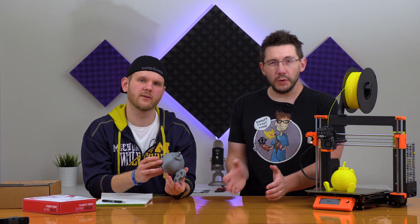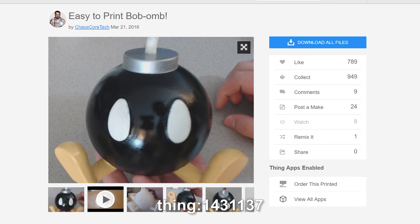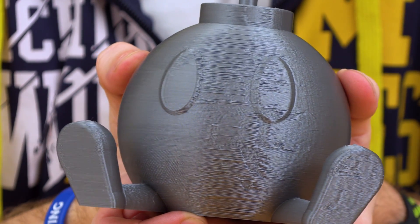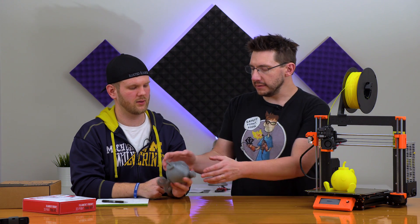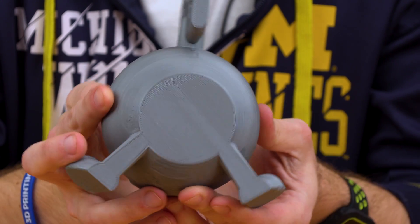When I was in Seattle, Sean texted me saying he was having an issue with his Prusa machine — it had never really printed well. He showed me this Bob-omb, designed by Chaos Cortex on Thingiverse. It's really easy to print: flat bottom, no supports. However, there were serious extrusion issues — it just looked like someone had scratched up the front. My guess was a nozzle problem, because the model looked bad up front but fine in the back, suggesting an irregular extrusion or an out-of-shape orifice on the nozzle.